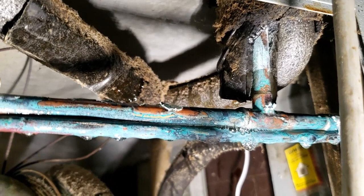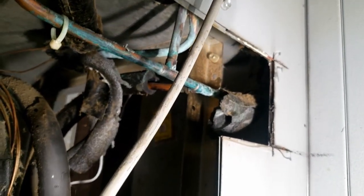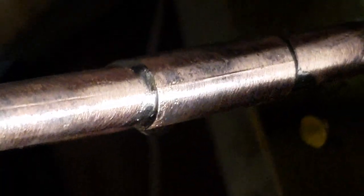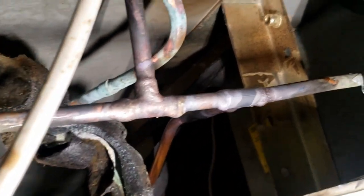We'll go ahead and re-braze that, then put on our tap and get it all sealed up with a good tap. Using a little hand grinder — not the strongest thing in the world but does a good job — I was able to get in to that back side. I'm going to clean that up with the wire brush wheel and re-braze it. You can see however they brazed this, they didn't have a clue — barely got enough in there, almost looks like silver solder. I'm also going to put a tap on the high side so we can monitor both sides of the system. Got those all prepped up and ready to go.